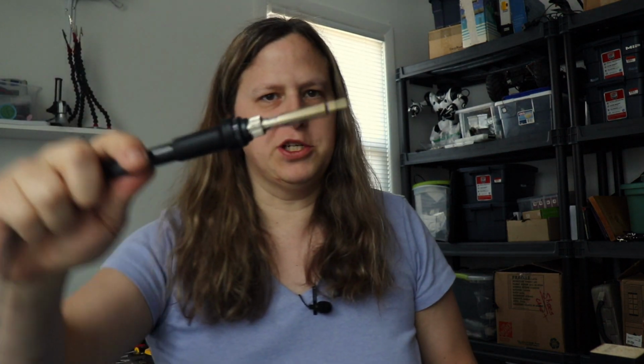Hi, I wanted to give you a few updates. First of all, on this bracket I started installing it, and it kind of split here when I was trying to insert a nut using the method recommended in the Prusa printer manual. So I printed off another one, but this time I decided to use a heat set iron here. It has a special tip.